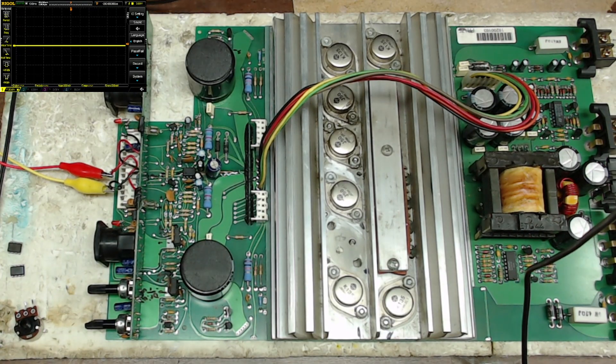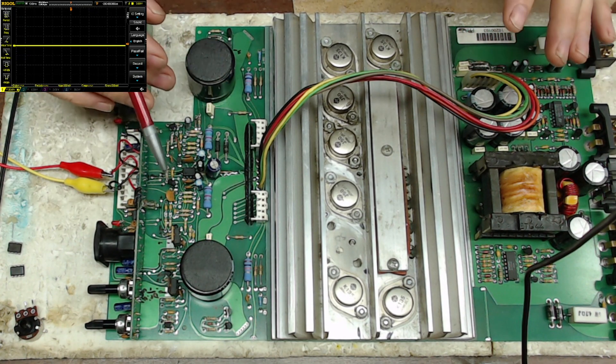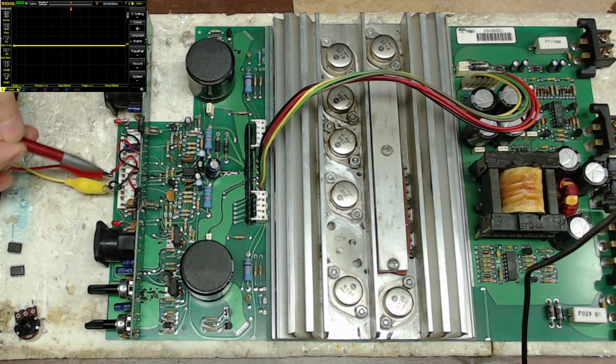It's a really interesting setup — your input is over here. To disassemble these boards, I won't say it's a nightmare, but you have to do some things to get the board out of the heat sink. You have to take the RCAs and desolder the RCA jacks off the wires to get the board out without a lot of frustration. I've got alligator clips going back to my signal generator.